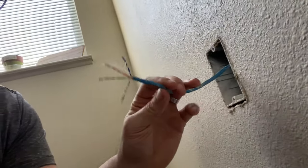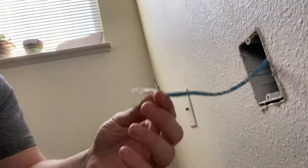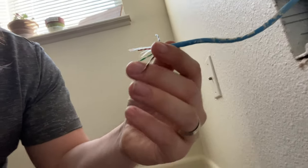And the cool thing about that is when you're taking wiring that's already inside of a house, I'm trying to be considerate, so I'm not taking a whole bunch of cable. So if they want to turn this back into a telephone line, they can. They have enough room to rewire it as RJ11. Not bad. RJ11 doesn't even use all of these pairs. They only use two pairs.